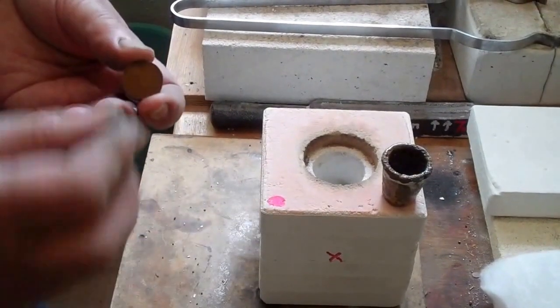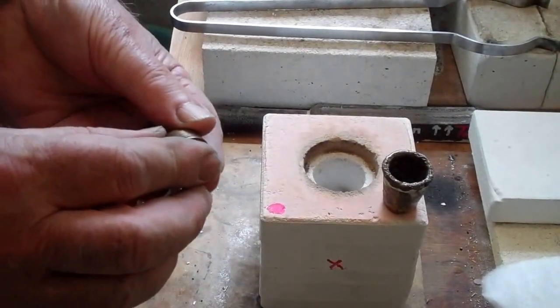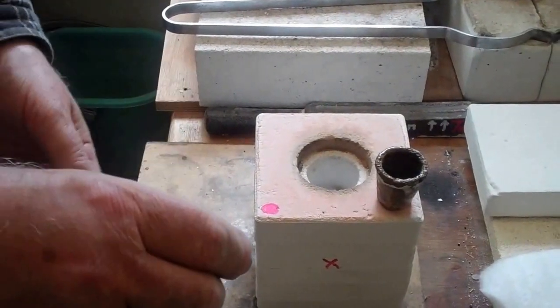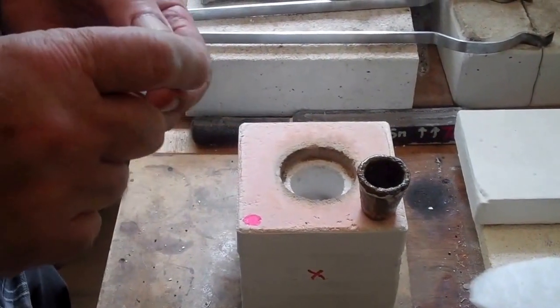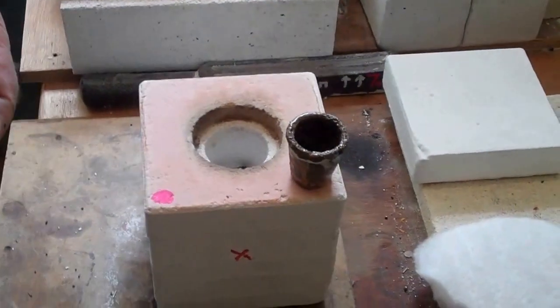So we just take that as tin, and this will give us a 95% copper alloy — a bronze, or alloy of copper, which we call bronze. It comes out to be a very nice rose bronze, my favorite casting metal: much more durable than gold, equally attractive, and casts nicely.